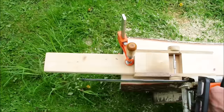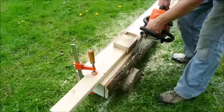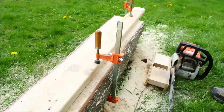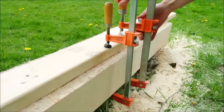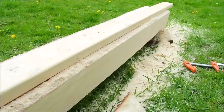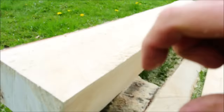I didn't want to make screw holes anymore, so in all the follow-up cuts I use clamps whenever possible. In order to use clamps you have to do this little clamp dance where you move the last clamp from behind the chainsaw back to the center of the board. Most of the work here is not chainsaw work — it's work that takes place around the chainsaw: lots of carrying and grabbing things and running back and forth. The best thing about this process is that with each cut, subsequent cuts become easier because the log isn't as thick. About 15 seconds from now it is pouring rain.